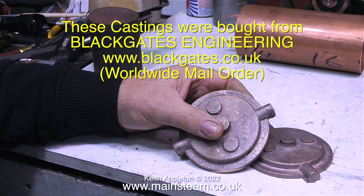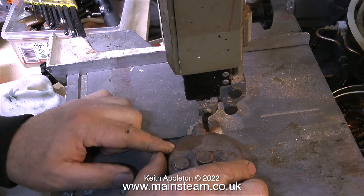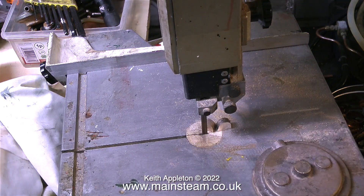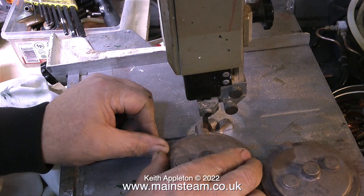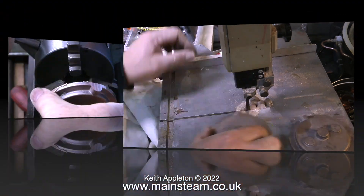In this clip I'm persuading the coil into the tube using a scrap piece of mahogany. I bought these two castings from Black Gates Engineering — I used some like this when I made a condenser oil trap for my Stuart Victoria steam plant. These are actually castings for the water preheater of a model Clayton steam wagon; I just need to modify them slightly. Rather than machine off the protruding parts, I'm cutting them off on the bandsaw.